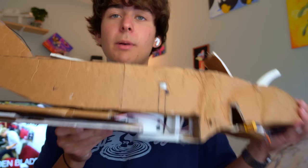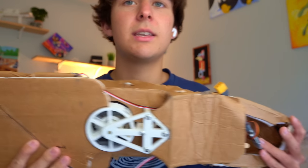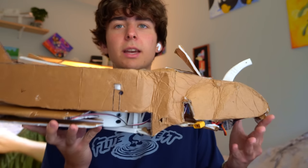On this design, I want the wings to be on top because having them on the bottom caused a lot of problems where these gears would actually strip out because when you go to land, the wings will be out. And if you don't remember to swing them in time before you hit the ground, they are likely to get stripped out. So with all that in mind, one servo, more simple, 10 times lighter, no brass rods, no bearings, less screws, tighter gears, wings on top. Let me show you the CAD model I came up with.